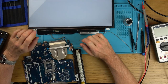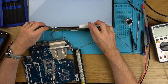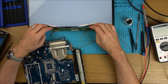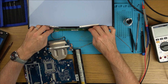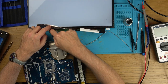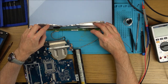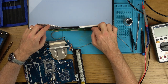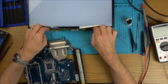Right, so I've just set it up here. You can see that I've got the on and off switch here, battery balanced in position. But yet, when I go across these ones here, like for example on the old calculators and digital phones, when you put pressure on down here, you could see segments come back. But look, I can't see anything changing when I do this. I can see that there's a line down the middle when I put pressure on here. So this side must be to do with this side, and this ribbon cable is to do with this side. But I think it's just, for example, the resistance of my fingers when I'm moving across here that I can see slight flickering. But look, I'm putting a fair bit of pressure down there. You'd think I'd see some lines come back to life. So annoyingly, I don't think it's that.